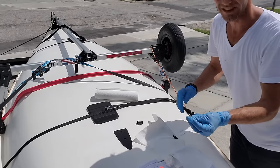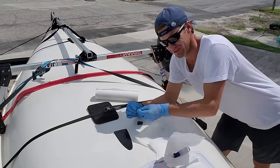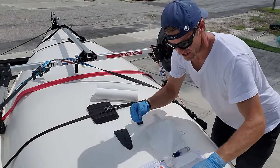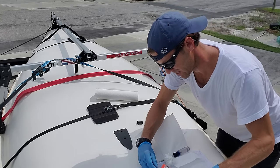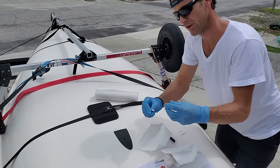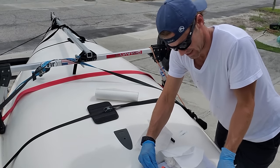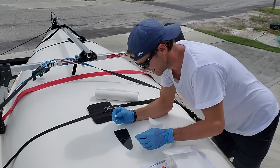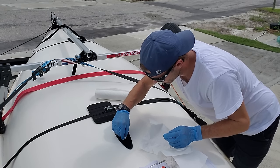Now if you're changing this because your springs or rubber bands went bad and you pulled it out, you're probably going to have some old 4200 or 5200 gunk on your hands, so make sure you clean all that off to get fresh sealant. Slide this in here — I like to douse the screw in sealant, and a lot of times when you screw it forward it'll push the seal all the way up. Cover it — that's all you need.